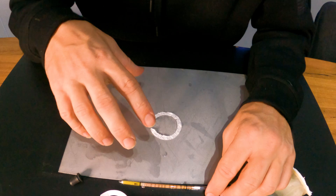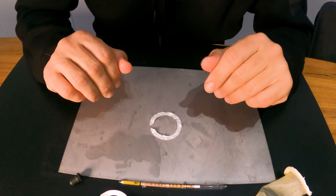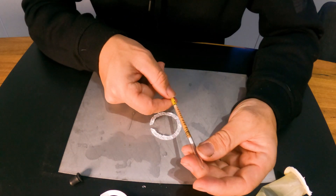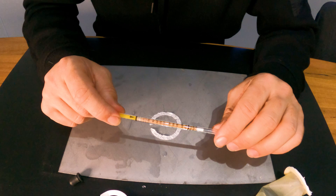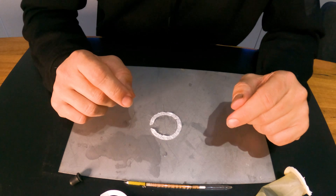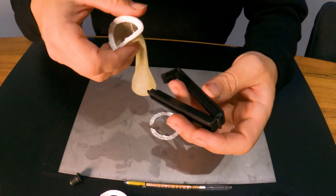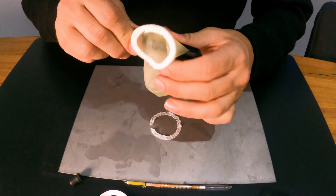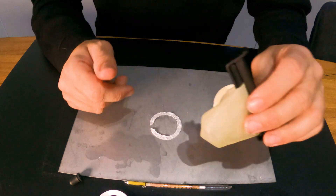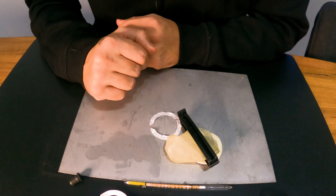The ways to remove salt are to keep blasting or do a high-pressure water wash — that will get rid of the salt content in your steel. Personally, I wouldn't have three parts per million on my boat — I'd wash it again, because given the effort you go to painting a boat, you'd want to make it better. If you ever need to do another test, you can clamp the solution device up, store it in the fridge, and if you're unsure retest it at a later date. So that's the test — as simple as that.